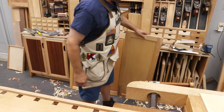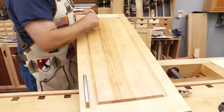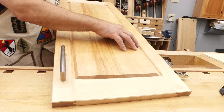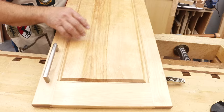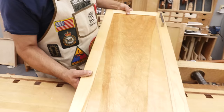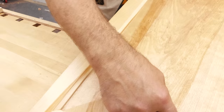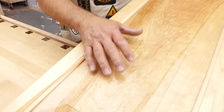If it's an inset door, meaning it fits inside the frame, it has to be dimensionally stable — it can't get wider and narrower. So you have a panel inside a frame that is essentially stable. This frame is not going to get any wider or longer. A simple quarter-inch plywood panel sits in a groove, covers the space, adds stability to the door, but doesn't add a whole lot of form — it's not that pleasing to look at.